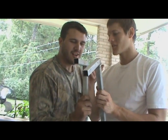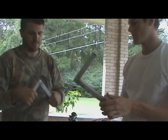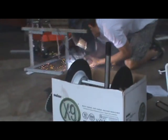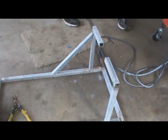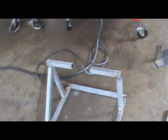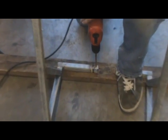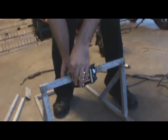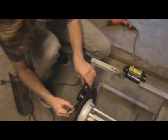Next you want two L-shaped pieces like this that are at least 12 inches tall. You want to put those four inches away from the front of the frame. Make sure there's a three-inch gap between the two because that is where the fairlead will go. Next, you put two 45-degree angle pieces as seen here — these will hold the spool. You can drill the holes for your winch fairlead and then attach it. Go ahead and mark where you want your pillow blocks and then drill the holes so you can set your spool up.